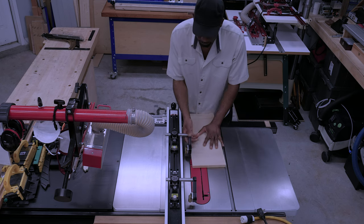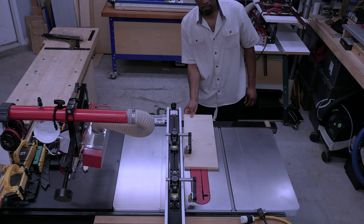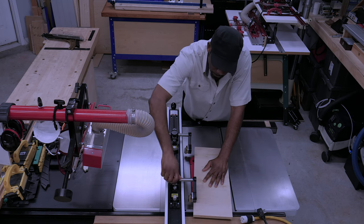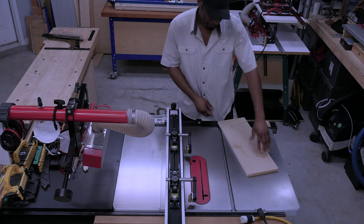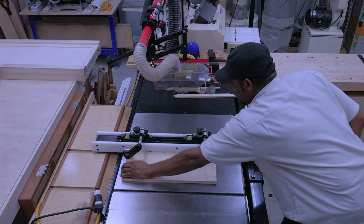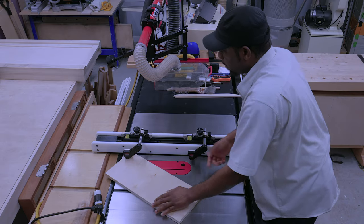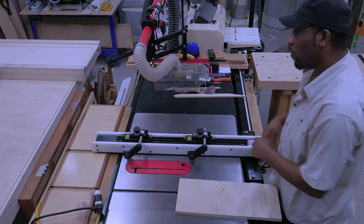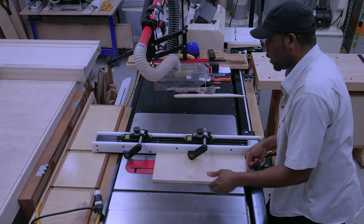And you see, this is the anti-kickback function. When using two, same idea up front. Always keep it on the right side of the blade. This resists the tendency for the board to kick back. The other great feature is that the wheels only roll in one direction — that's why it doesn't come back at you. It only rolls freely in one direction.